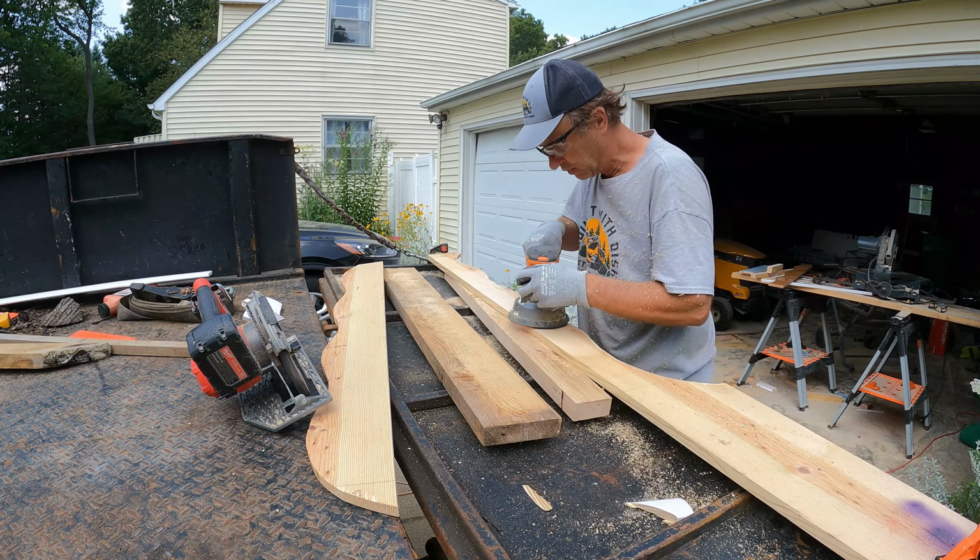Well, the last cabinet installed, this one took a little more extra work. The floor right in this area for this last one was just so bad. And trying to level it, shim it, I ended up tipping it over and actually sanding out a little area, tipping it over, putting it back down, shimming it into place. It's not what I planned on doing, but sometimes you gotta do some different things to make it work. So now these are all perfectly level, really nice.